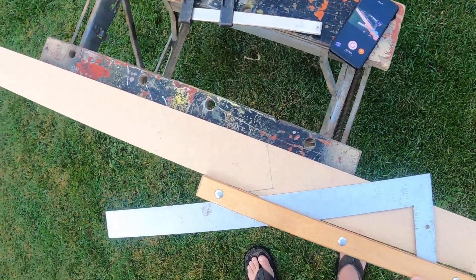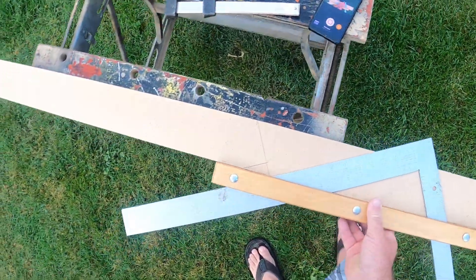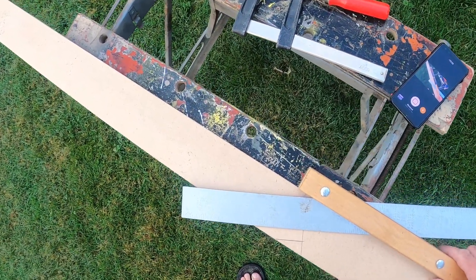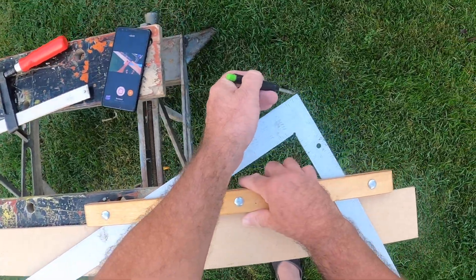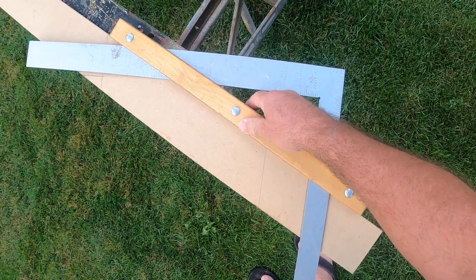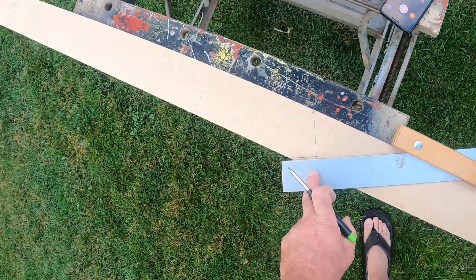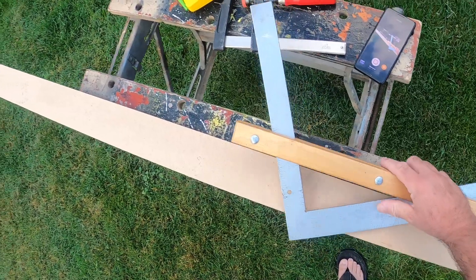There is my bearing. The nice thing with the gauge is we can measure one foot of run without having to do the calculation of our unit length. The same thing applies when holding the framing square this way — you could go to 17 inches; 17 inches from here to here is outside of fascia, and inside of fascia. Remember this is an inch and a half, so you can measure your projection a lot easier when using the gauges, because you can go all the way up to a 23-inch run with your framing square. That is how you lay out a common rafter with the framing square.